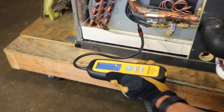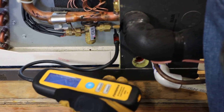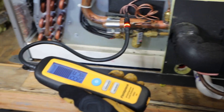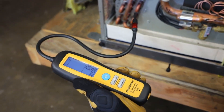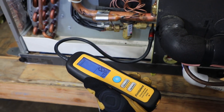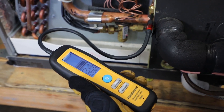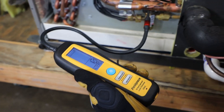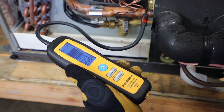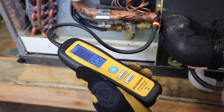So now I'm going to check out a couple of mechanical seals, starting with this TXV, to make sure that we don't have any leaks down here. Looks good. Now I'm going to make my way up to this equalization port and I get my first hit of refrigerant indicated by the LED tip. I'm going to pull it away and bring it back in for a second pass to confirm. The new Fieldpiece leak detectors have four ways to indicate increasing concentrations of refrigerant: a numerical value that increases, a bar graph, a lighted LED tip, and an audible beep that increase in intensity as you pinpoint the exact location of the leak.